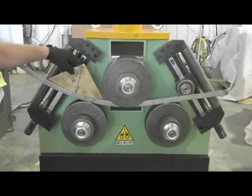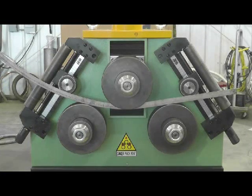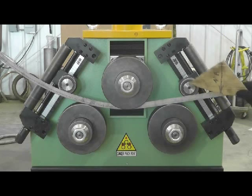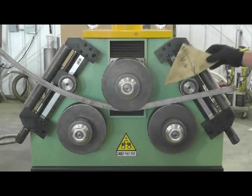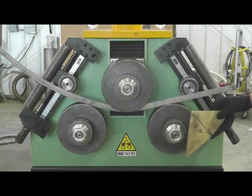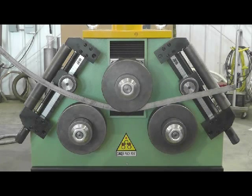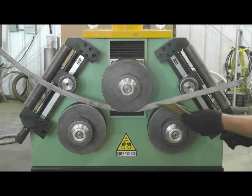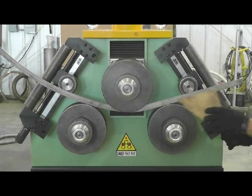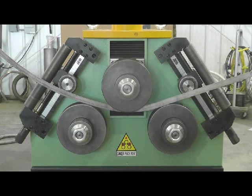And then we'll have our four-foot radius. I'm going to roll a third pass with this piece. I've backed my cam rollers off. Once again, I'm going to move the forming roll down, looking at the flexion through the rolls. I'll be pulling the radius out slightly so I can actually overbend slightly. Now we'll roll through. I want to disengage it until I pick up this radius here. Right here we are — we're picking it up.